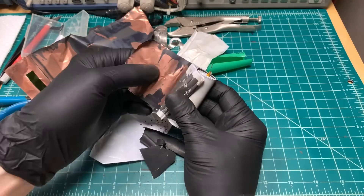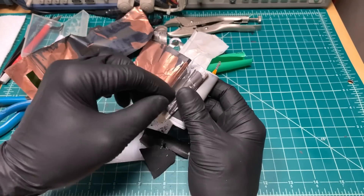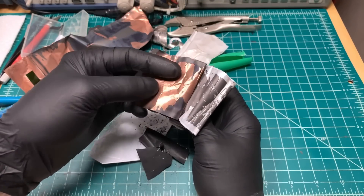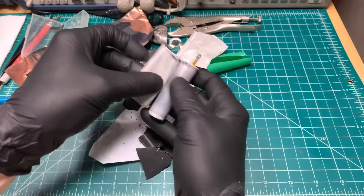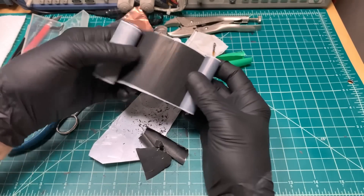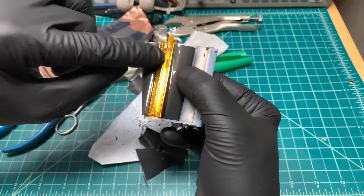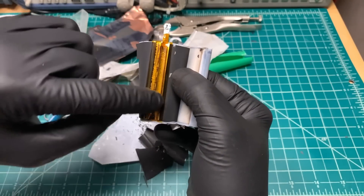When it's all rolled up, it certainly works much better. For other types of lithium ion batteries, they typically adjust the positive end chemistry. They are also working on things like graphene for the negative end to help improve performance, increase capacity, or increase current handling. Going down through here, you can see it's just rolls and rolls. The longer the roll, the higher the capacity because you've got more of this battery goop. We're looking at the aluminum foil with the positive battery goop on it, and then we get to the point where the tab is clamped down and spot welded onto the aluminum foil.